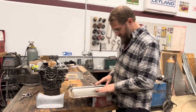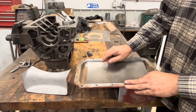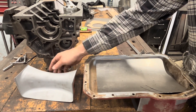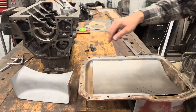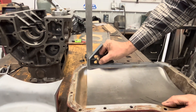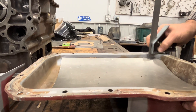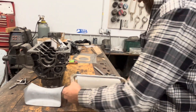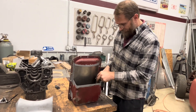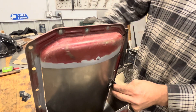What I decided to do was put this thing in where the top edge is a half inch down from the top of the pan. That puts the bottom of this just above the edge, far enough to give me decent oil drainage. So I'll set my square for a half inch — this thing fits in there nice and tight — and just push it down to where I'm at a half inch all the way around. Then I can tip it on up since it fits fairly snug, take these brackets, and clamp them in where I want them on both sides.